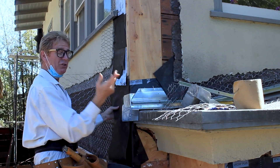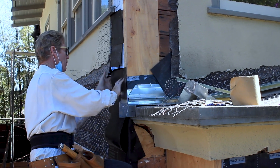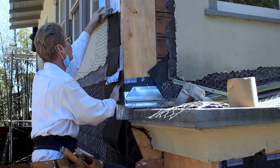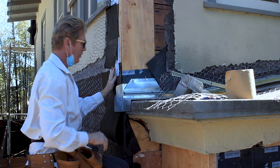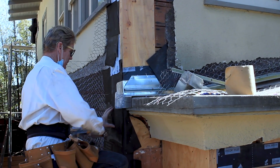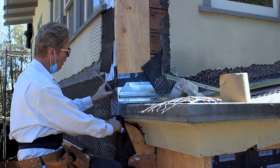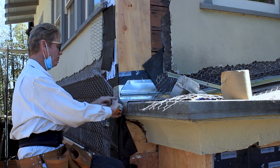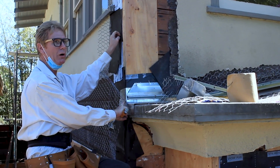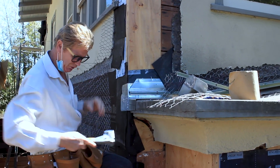I already attached paper under this because it's a counter flashing. So if I'm going to redo it just to show you guys how to do it — this is how you do it. You take your flashing, your two-ply membrane, you put it down. Then you take the additional membrane for the window and put that over it. With that over it, you just tack it down. Now that is done. This wire can go over this saddle here — when the stucco hits here, this takes a little bit longer to dry because the paper absorbs the stucco. The metal won't absorb it — no big deal.